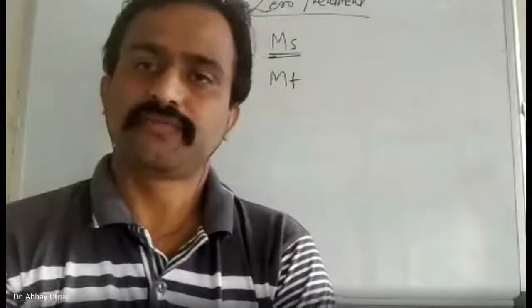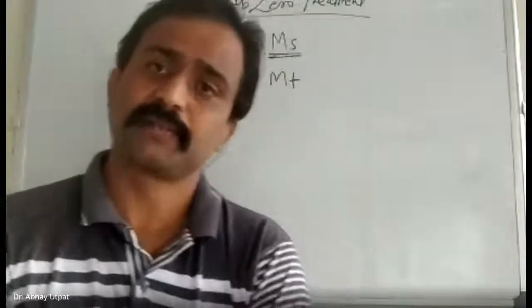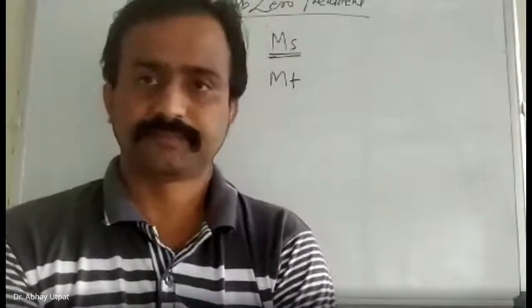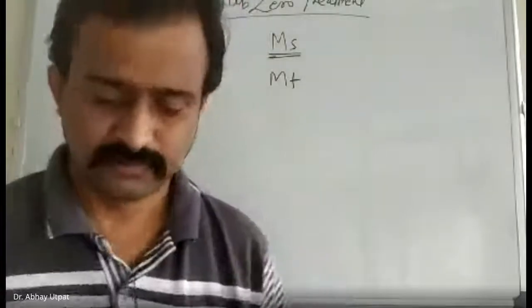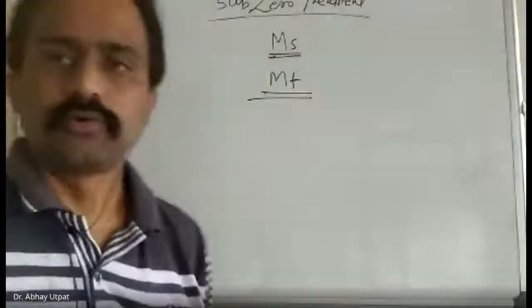MS and MF temperature. If you can't remember, you write the long form: martensite start temperature, martensite finish temperature. MS and MF temperature. Full stop. 100% martensite is obtained in one stroke, only by cooling below MF temperature.